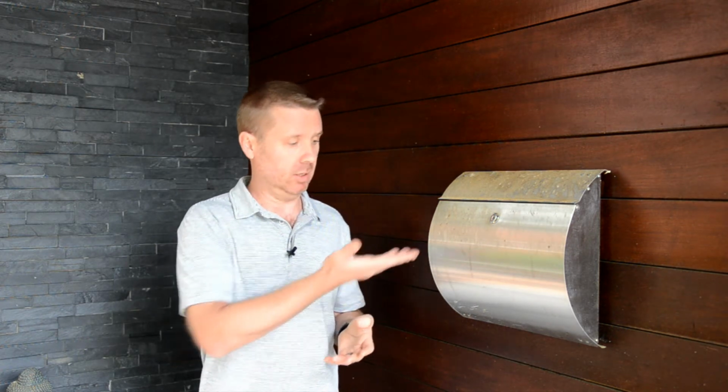During your exterior inspection, you'll want to check for any metal that is rusted or needs to be cleaned. This can range from screws, bolts, hardware, to even say this nasty mailbox. You'll want to address rust as soon as possible so you don't have to replace any expensive metal hardware. For bolts and screws, these are relatively cheap, so I would suggest replacing those with their stainless steel version.